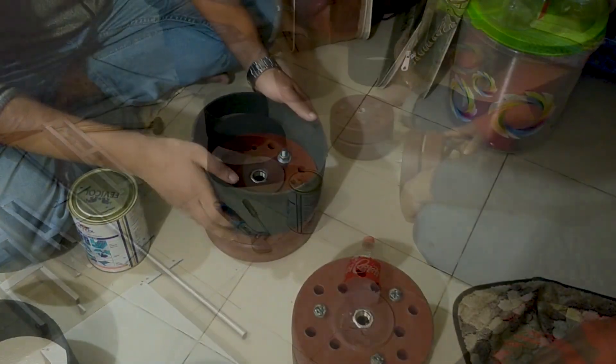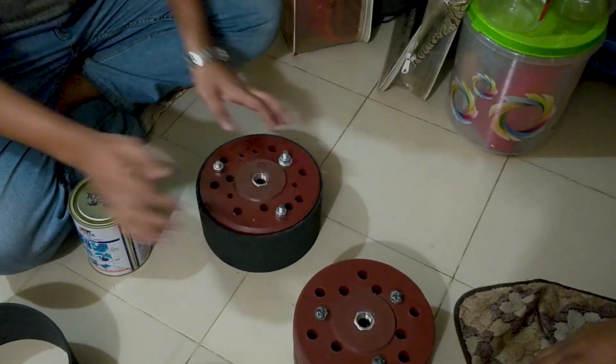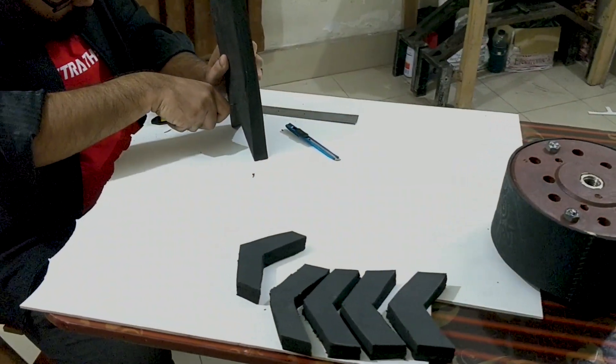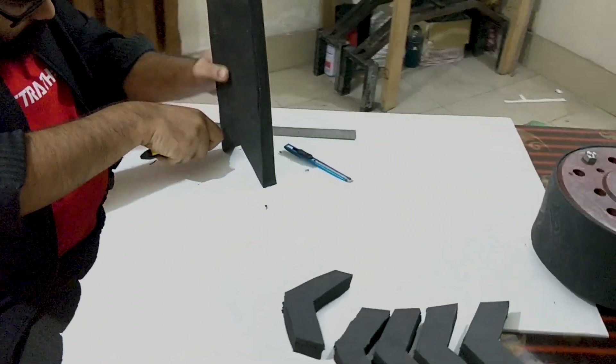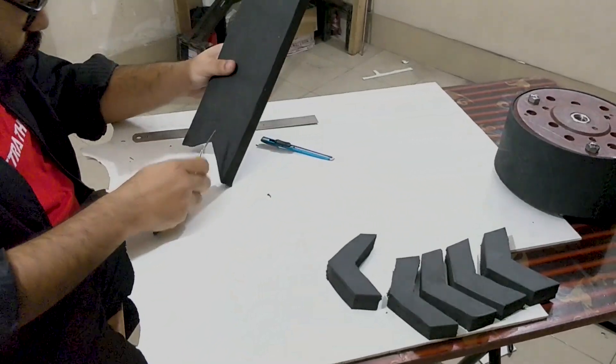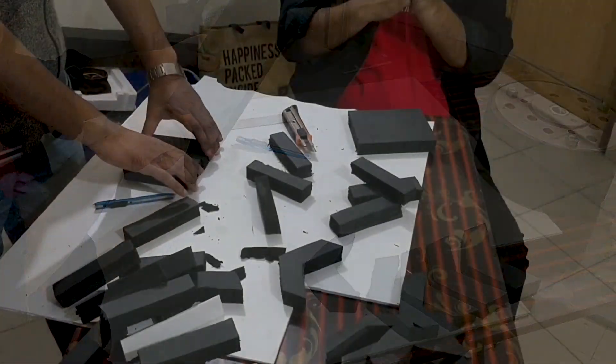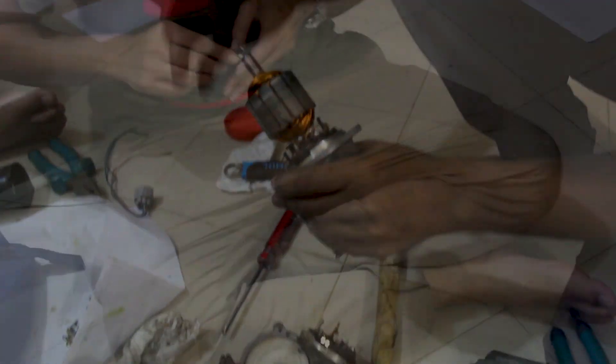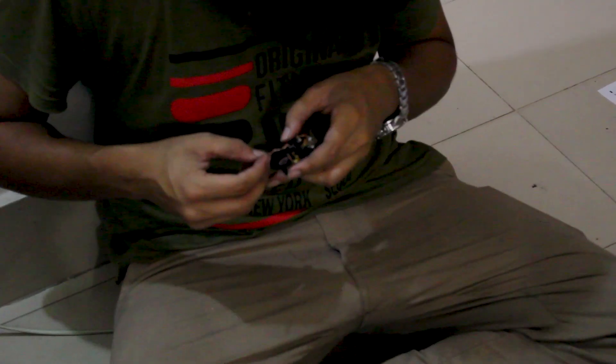We have designed custom-made wheels for the Rover, which are eight inches in diameter and five inches in width. We used one-inch rubber grips on the wheels, which primarily act as better contact with the ground and secondarily act as a shock absorber. Four DC gear motors have been used, customized by our electrical team to make the motors more capable of performing tasks in any circumstances.